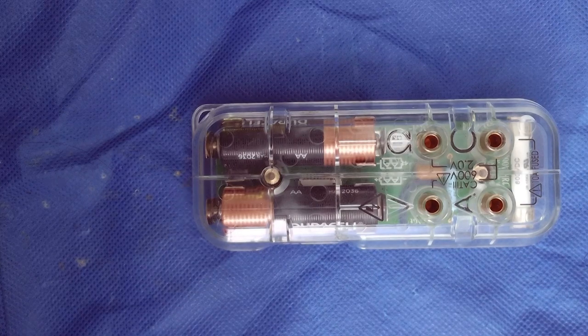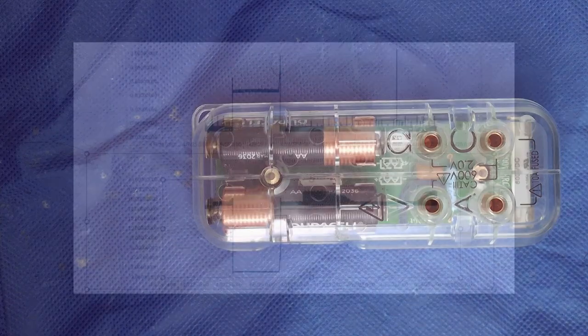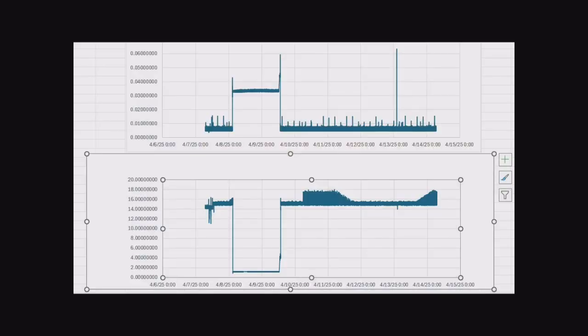And the great thing about this is you would be able to import that data and come up with this graph. Now, I had a real good technician, still have, still works for the company, who figured out a formula where we could not only do these, but it would actually show, and if you look close, you'll see the dates and the times below. So we'd be able to know it shorted on this day at this particular time, and this is exactly what it did. Because you can look at the bottom and see where the voltage dropped, and you look at the top, you can see where the current went up.